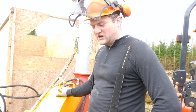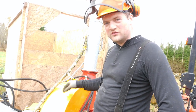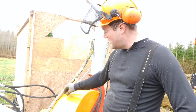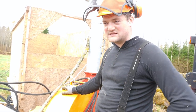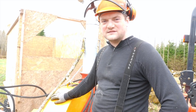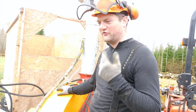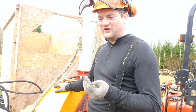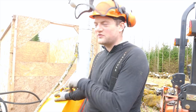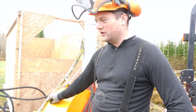The big difference that makes this a high quality machine is in fact the wheel to which the blades are connected. On cheap machines that look good but aren't, the wheel where the blades are connected might only weigh 20-30 kilos and you may only have two blades. Here we have four blades and this wheel weighs 100 kilos. So once the tractor gets it going, there is a lot of force working without the tractor constantly pushing. It'll take a little time to get it back up to speed, but this is what enables this little 22HP tractor to chip through thicker branches — that's what you want to pay attention to.